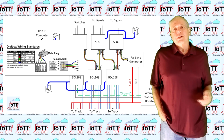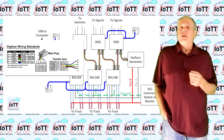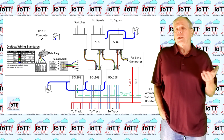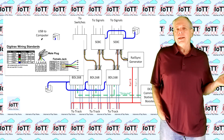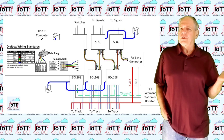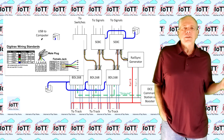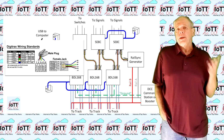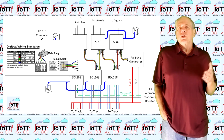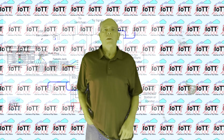And finally, the whole grounding topic may become a non-issue if you have your components connected by a communication bus such as Loconet. In that case, the Loconet cable carries two ground wires which provide common ground to all connected devices. The only thing that remains to be done is making an Earth connection somewhere in the network. Usually this is done right at the command station.